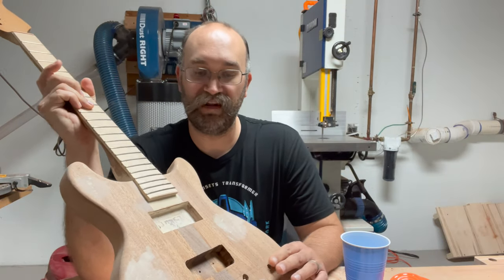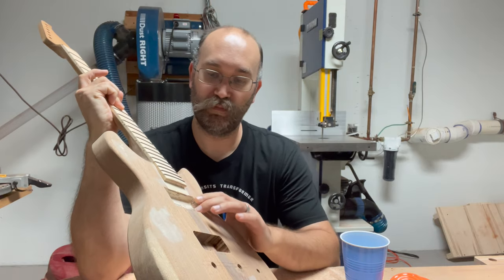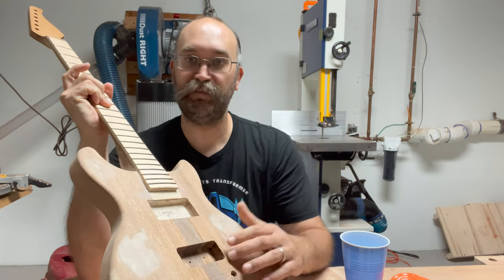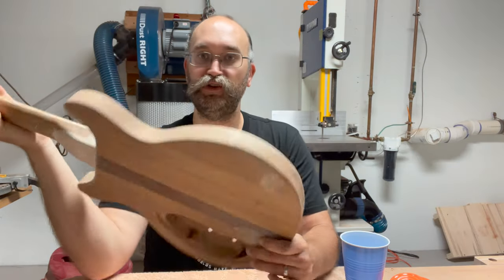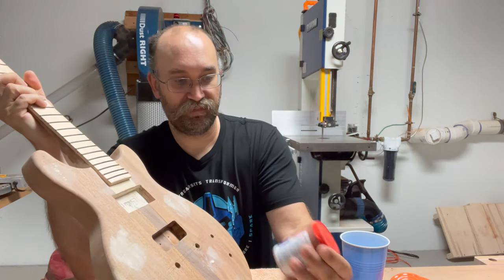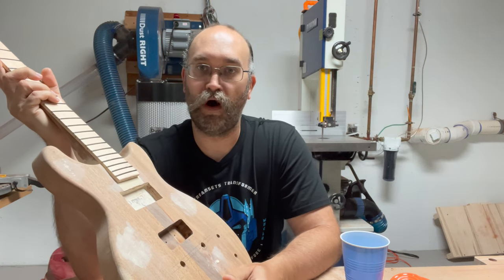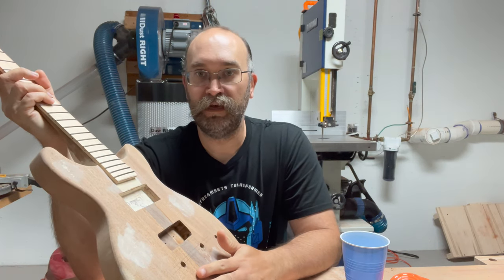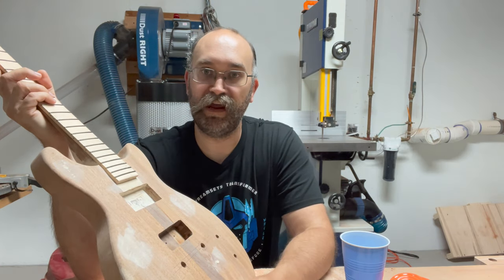I finished up all the fabrication on this guitar, and I've already gone over and used some wood putty in some of the deeper grooves. So now what I'm going to do is take some Timbermate wood filler and thin it out with some water to get it to kind of a melted peanut butter pudding-like consistency, and then use it to fill the grain.